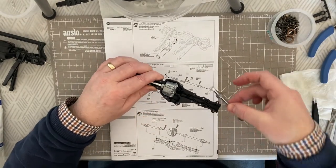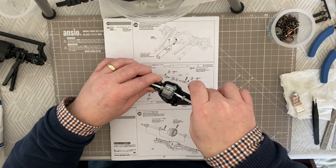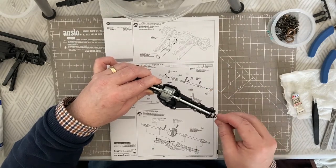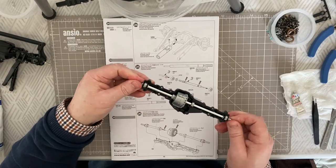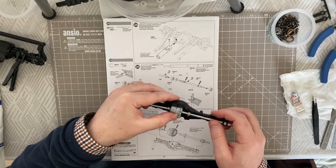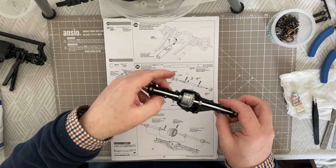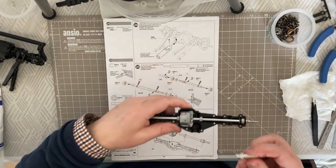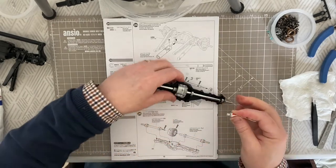So on the other side, we get the other shaft, which is our MC26 shaft. And again, we locate that, locate the bearings in place on the shafts, and we make sure they are engaged. And there we are, which they are. And the spacers are down, and the bearings are in there. So there we are, that's engaged. We've got enough grease on there. And we can now move on to the next step, step 27.